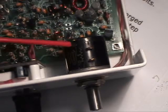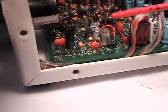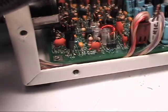The diagram for the pot is marked right on the pot on the particular one I have — this is the wiper and these two will be the ends. I've done the zener diode replacement to a 78L08, which basically means you just take the diode out, take the 100-ohm resistor out, and plug the 78L08 in. So I have a regulated 8 volts to go up to my varactor.